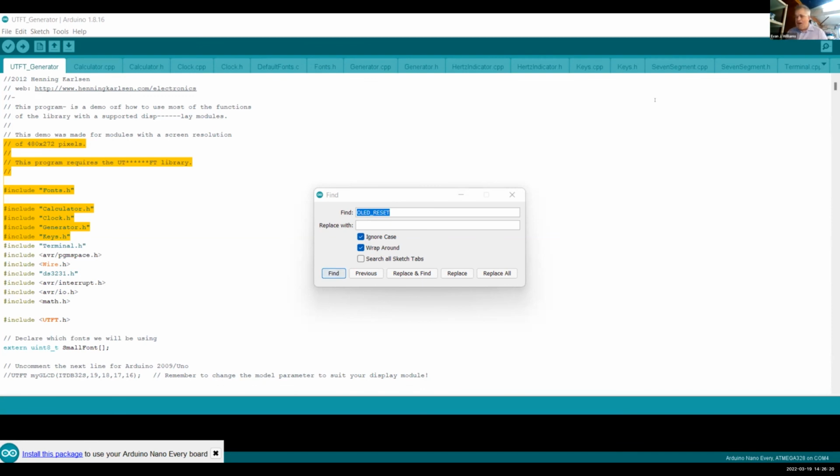I'll tell you a funny story that may help you understand how to think about these projects. I started with Uno 5 years ago or so. I'd been in programming for a long time, and I kind of thought I knew it all. And I thought, wow, these shields are great. I can just get several shields and stack them up, right? Well, you have to make sure that the lines don't conflict. If you have a shield that measures temperature, and you've got the library working, you can't just put on the shield for the real-time clock. Now you have a stack of pancakes.